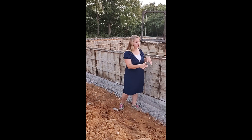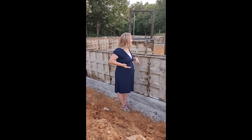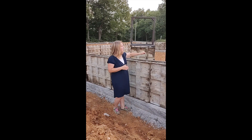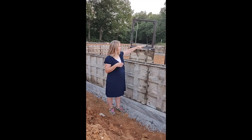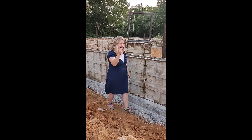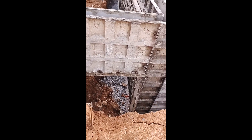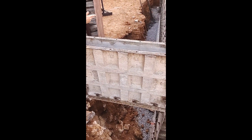I'm standing at the garage. Where I'm standing, this is all going to be filled in with dirt — like waist to chest high when they fill in. This is the level of where the garage floor will be, so our tires would be at this level. To make it more solid and a firmer foundation, they'll put slate down, then probably some crushed stone, and then pour the concrete on top of that.